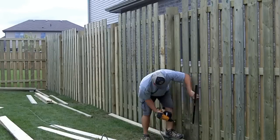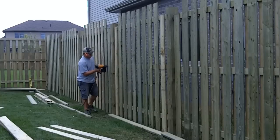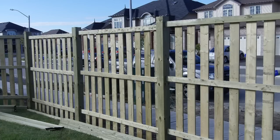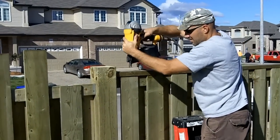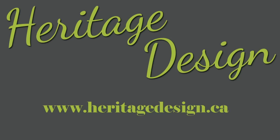Once you get a hang of things, it'll go pretty quick. If your fence has a middle stringer, the boards are already lined up and ready to go, and you can go ahead and just tack them on. And that's it — one side of the fence is finished. Now head over to the other side and do the same thing. Once all your boards are on both sides, you can then move on to your top, whether you're doing a 2x4 rain cap, lattice, or any other option. Thanks for watching this video. Keep your eyes open for more at heritagedesign.ca.